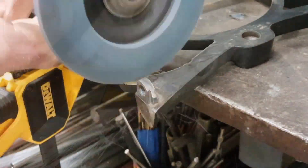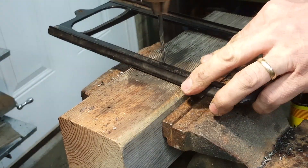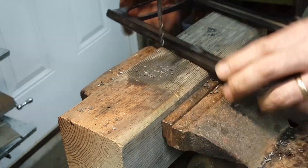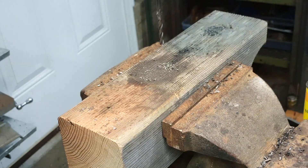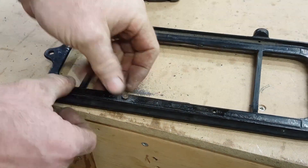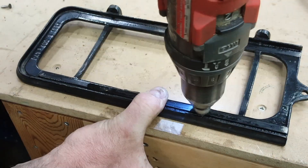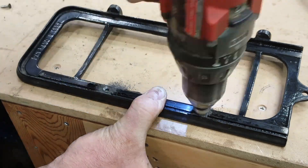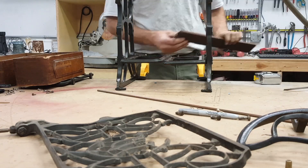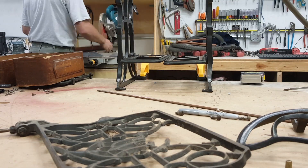I'm cleaning them up so they won't rub against the shelves — they were sticking out a little bit, so I reduced the profile. Now I have to keep the bottoms from spreading apart, so I'm going to drill some holes in the lower two shelves and pin them together with a block of wood. I'm running countersinks so the screws will flush down, since this is right where the shelves slide. This is the only thing in the lower area that keeps the legs from spreading apart.